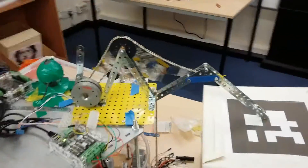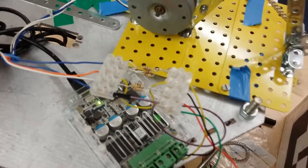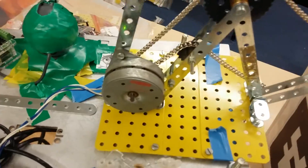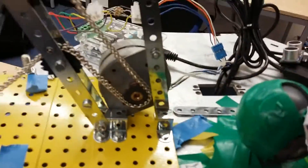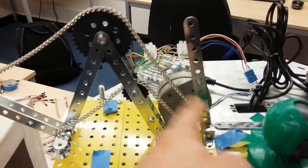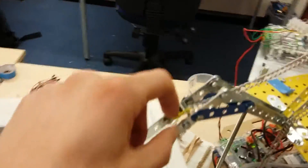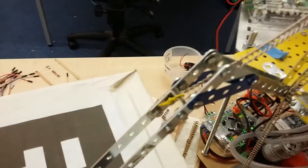This is our current stepper motor lifting design. It uses the motor board, uses resistors to drop the voltage, goes into a big stepper motor which goes into a small cog, which uses this cog up here to make sure that more of the cog is connected to the chain. It goes up here and over to here, and is attached by some very secure wire.